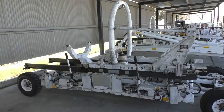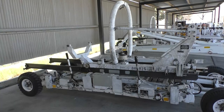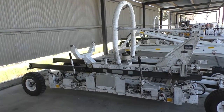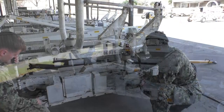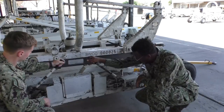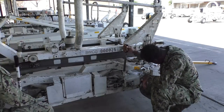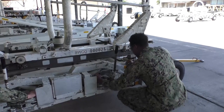The next part of our pre-operation inspection will be the functional check. This inspection ensures that the trailer's moving parts and safety devices are in proper working order. Be sure to exercise safety when raising and lowering the table. During these steps, ensure that verbal calls are made, such as 'clear the area,' 'raising,' 'lowering,' 'stand.' Ensure the call is received by a confirmation call of 'area is clear.' Raise the lift past the first locking position, visually inspect actuation, and watch for any leaks or binding action. Slowly release hydraulic pressure. Ensure both forward and aft safety poles engage and the stand does not lower past stops.